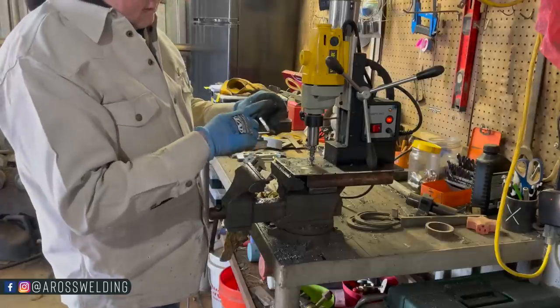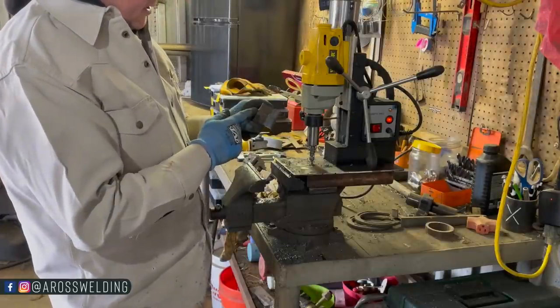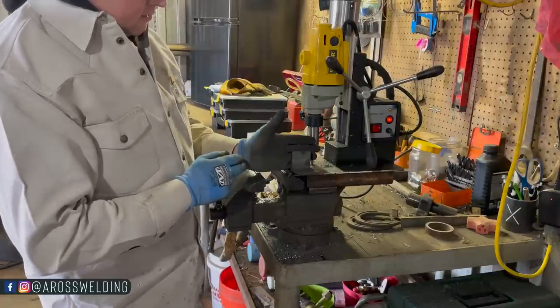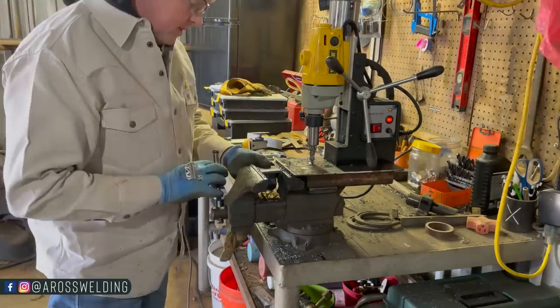So I've just got 2-inch by 2-inch, 1/4-inch thick angle. I come in 1 1/8 inches here, just to get away from the sidewall a little bit, because this would be like here, and my 2-inch square will be back here, and my hole will be here to run a bolt down.